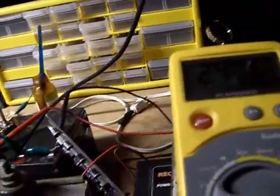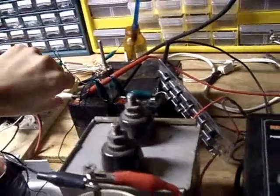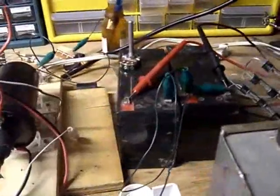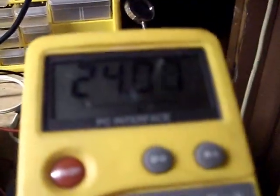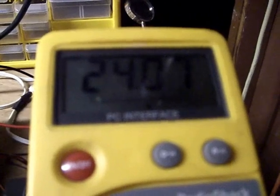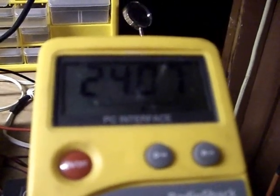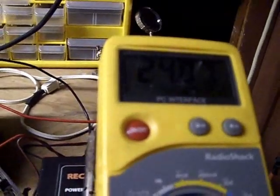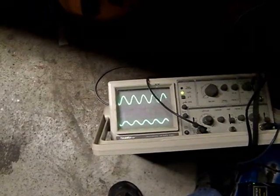To show that this really is in the loop — it's at 24.06 — I'll disconnect the battery totally. It's not even connected, that's just the multimeter there. And this battery is 24.07 and you saw it hit 24.08, because the battery is rising since it was really in the loop. You can see that it's 100% just running on the capacitor right now, there's no battery power involved.